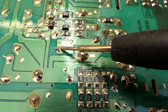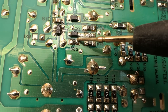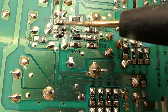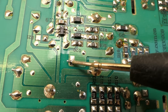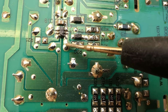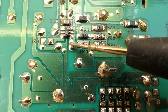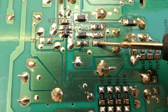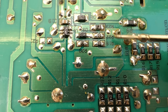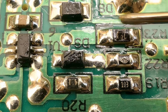These pins are the exploded resistor. The gate of this transistor is connected via some resistors and a diode to the output of the chip. The source of the transistor, which goes to the current sensing resistor, also goes via a small resistor into the chip for current sensing purposes — this is probably the current sensing input. Here's the typical 10 kΩ resistor between the gate and source of the transistor.